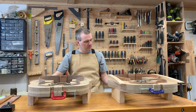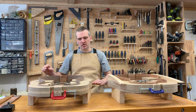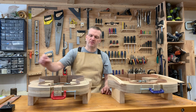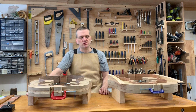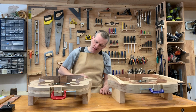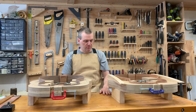As for the front tops of my guitars, like I said, I will leave those flat, because I don't want to build two dishes, and radiusing the top is also a little tricky from what I read, because you don't want to have an arch where the neck is coming in on the fretboard. You don't want to have a little hump on the fretboard. So my tops are going to be flat, and my backs are already arched this way using the plan and those ramps, and I will be using the dish to round them all around. So the next step will be building the dish.